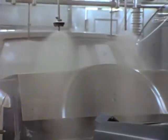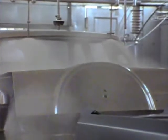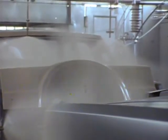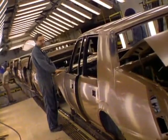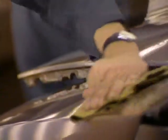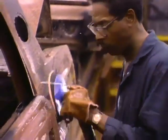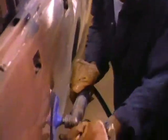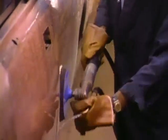After the E-coating is completely air-dried, the body is sprayed with an even coat of primer on an automatic prime spray line and thoroughly dried again in special production drying ovens. From there, the bodies go to a prime coat inspection area where they are thoroughly checked for any defects of any kind that would affect the final finish of the car. If any defects are found, such as rough spots or sags, they are fixed right there before that body can be released for finished painting.